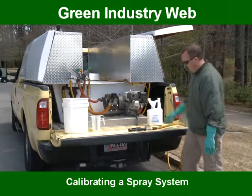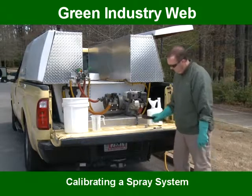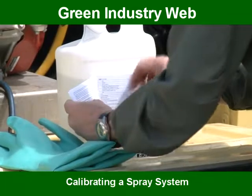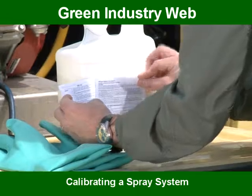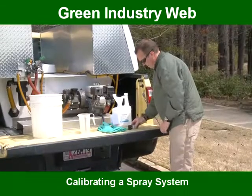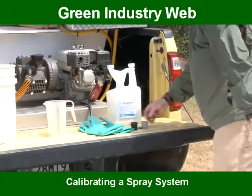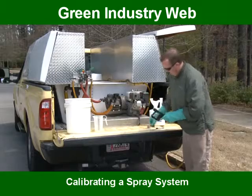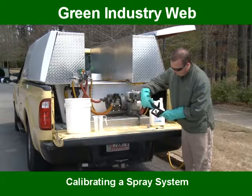When selecting a nozzle, you have to understand what droplet size and water output is needed for the application. Always check your label for the minimum recommended water volume to be applied with a product. Since you do not typically control your customer's irrigation and when they water the product in, this is a critical choice. Pre-emergent herbicides applied with higher quantities of water have a better chance of penetrating the grass canopy and depositing on the soil surface. Herbicides that remain in the canopy can be degraded by sunlight and even possibly removed by mowing. For this situation, we'll select a 4 gallon per minute nozzle.